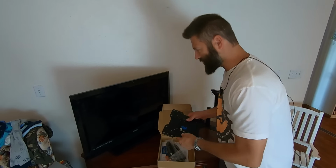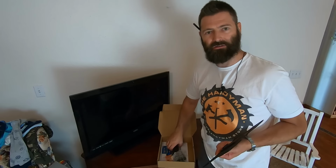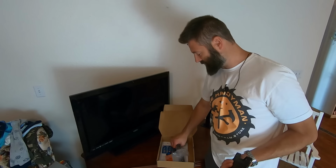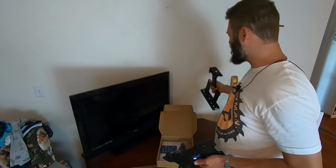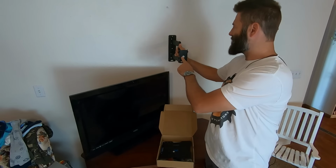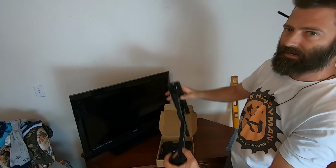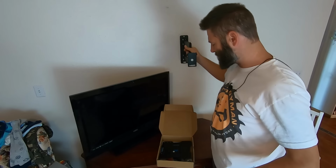Mounting the bracketry to the television, it's pretty straightforward. Most people can handle that just by reading the directions. It's like putting a toy together. It's not very difficult. The issue comes when you need to fasten this to the wall. Now, even though this isn't a very heavy TV, if you get it cantilevered way out here like that, there's a lot of force pulling on this top lag bolt here. You need it to go right dead center of that stud, or else you could kill somebody.